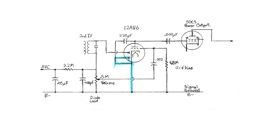Anything the cathode does, the plate's going to do. And all the cathode is going to do is be at signal ground, so there's literally nothing going on with this second diode. In other applications for detectors, you may see the second diode used. So that's that. The second thing to notice is we do have another diode right here, and that's tied directly to our upper side of our secondary on the second IF transformer right there. So that's an important thing to note.